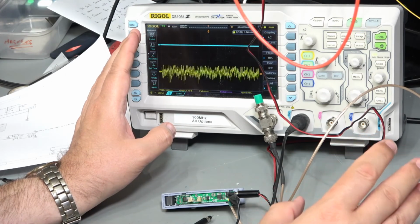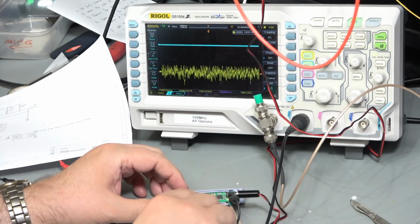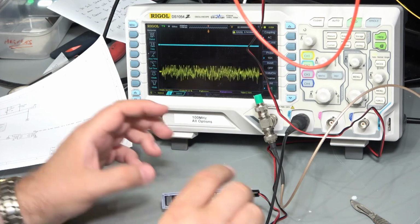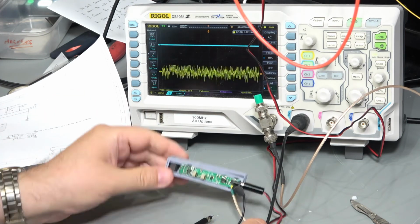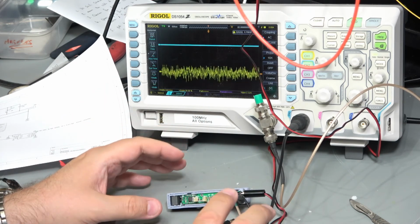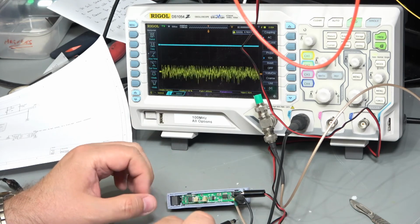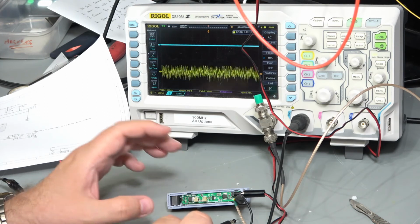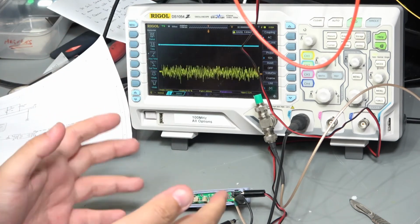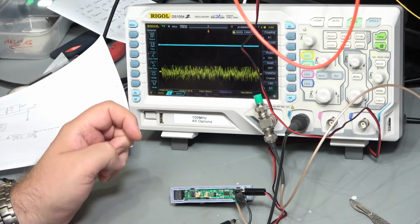So where does that leave us in terms of the probe? It means we've got a circuit that works okay for DC. Its negative side is that the zero is a bit oversensitive. The thermal problems have gone away, but the angle at which we place this in the Earth's magnetic field does affect it quite significantly. Part of that is because we've gone for a very sensitive circuit with 1 millivolt per milliamp resolution, and so that makes it 10 times more sensitive to the Earth's magnetic field than a commercial one that typically would be the type of thing we might buy off AliExpress or something.